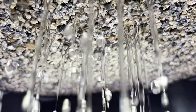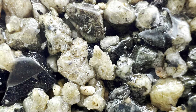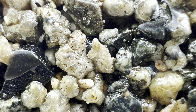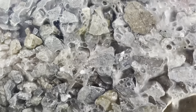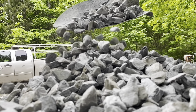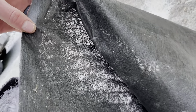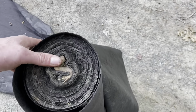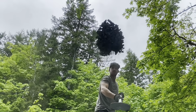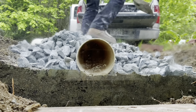We're going to look at some products from Romex. They're really leading the way in terms of different products for binding gravel and creating permeable surfaces. We're also going to take a quick step back and look at what an open graded base even means. That's what we typically use with clear crushed gravel to create a base for pavers or any other permeable surface. We also need to get comfortable using geotextile filter cloth to keep layers separate and keep the gravel clean from any soil.